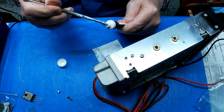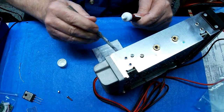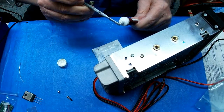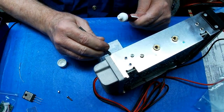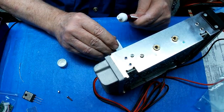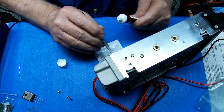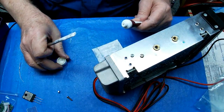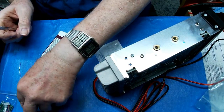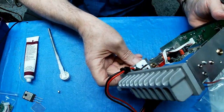Acid brush helps you spread this stuff a lot more evenly and smoother. And you don't want to put too much on there because you come up with this phenomenon called hydraulicking, where the grease makes a little air pocket underneath the component, which allows the component to get super hot. I don't want to put the lid back on there just yet. In that one spot, so you don't want to do that.